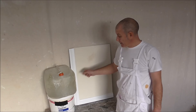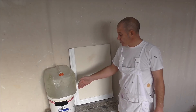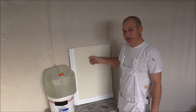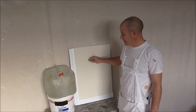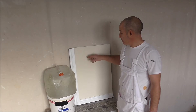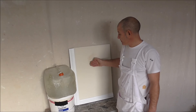The plaster has to be wet. If you're putting water in your paint, what it does is allow that paint to get onto the surface and sit there before it actually dries. Because if it dries before it's soaked in, all it will do is form a crust on the surface.